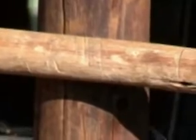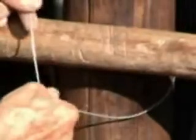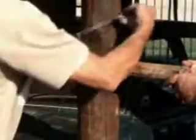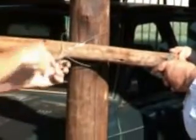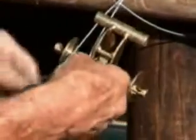Hold the bent area towards you so that the wire ends are bent around the back. The legs cross each other behind the poles and are brought over to slide through the loop. Hold the Cortool correctly. The wire ends are inserted into the holes on the side of the Cortool head and fastened at the notch.